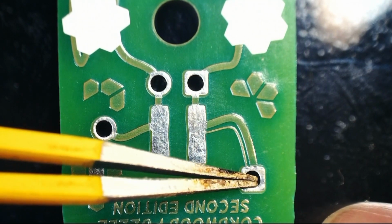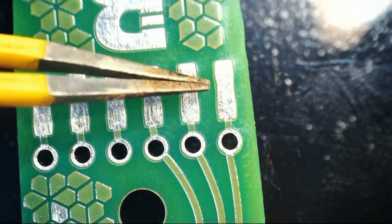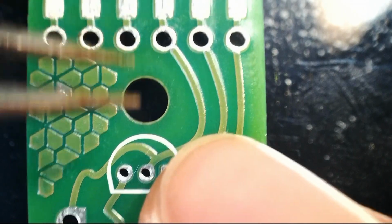By default, these lights would all be on, but you could ground these inputs to turn them off or connect them to a microcontroller, and this would be a logic level display.